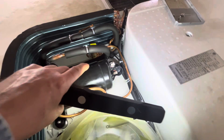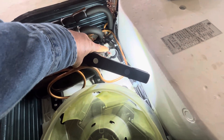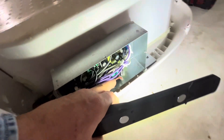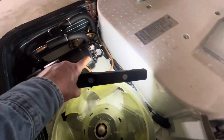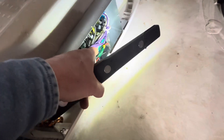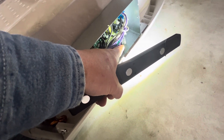I would also take the cover off the terminals for your compressor so you can verify continuity between the wires here and the wires you need to access in the boxes. In this case, we're looking for the brown wire. It's plugged into a terminal labeled compressor or COMP. I pulled that off and tested continuity between that and the brown wire connected to the compressor. When I verified it was the same wire, I then spliced in a 14-gauge jumper wire and plugged it back into the terminal labeled compressor.